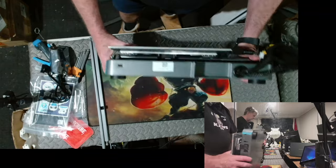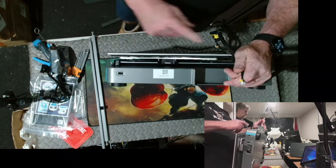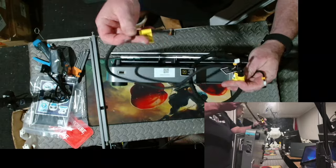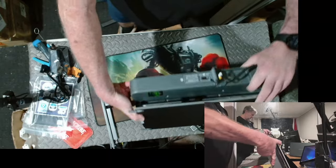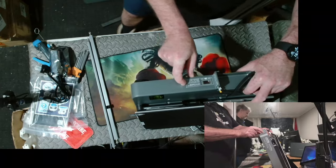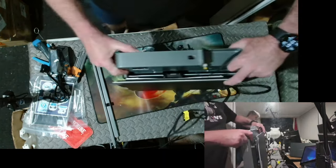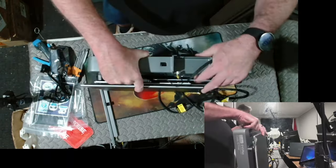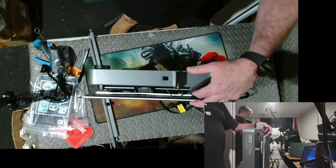You've got a USB on the side here, and this is the stepper motor connection that goes up to the print head. On the other side you have the all-important power switch. It's on 230 volts. So if you're in a place that takes 240 or 230 volts and you've got this set to 115, you're going to have problems — it will probably blow your board.